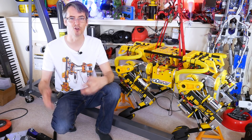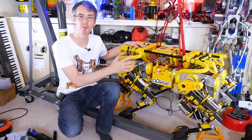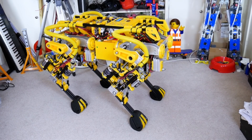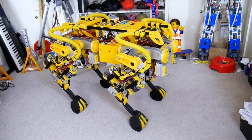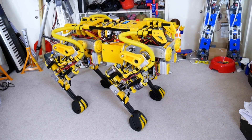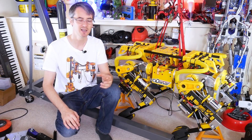Hello, it's the next part of robot dog development. For quite some time into last year I've been developing Open Dog, which is an open source robot. This robot has rigid joints driven by motors and ball screws. We've gotten quite far with that — doing an inverse kinematic model and doing interpolation for the motor positions so we can move the feet in perfectly straight lines, interpolating through all the positions on the way from A to B. But we still haven't made it walk properly, or at least not really dynamically.